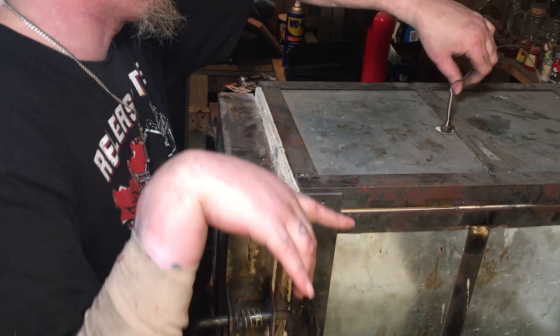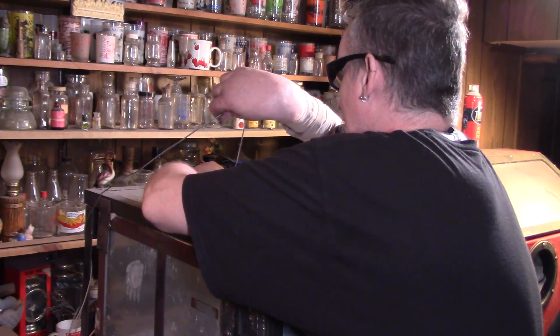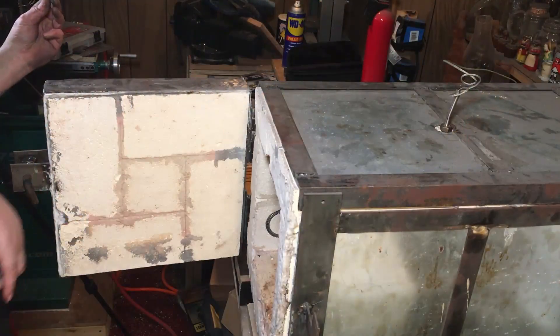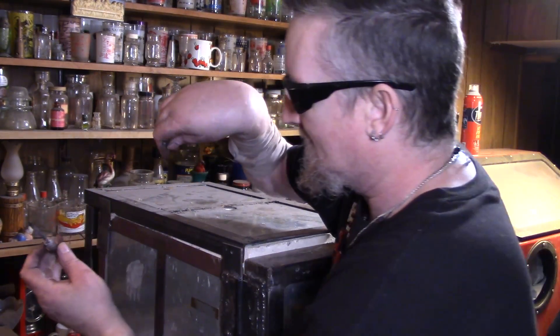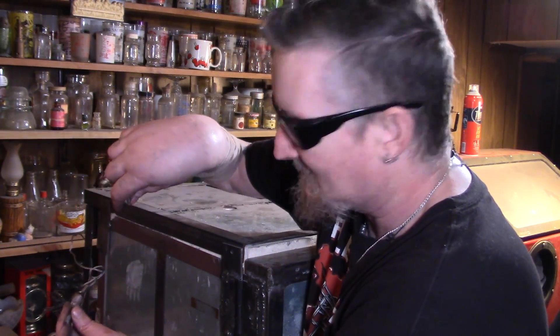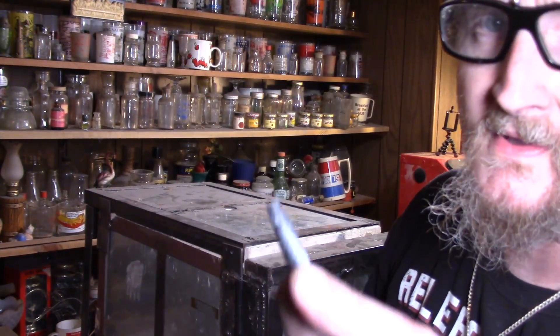...and easy to work with, I just drilled the hole small and then attached the bricks into it. Wow, looks like I need a new thermocouple too — glad I did this. Yeah, that thermocouple was about fried, so it's about time I replace that. So there's my first thing — look at that, it's right open. Glad I did this.